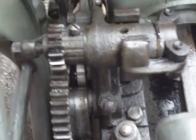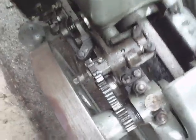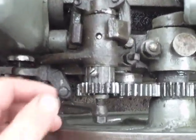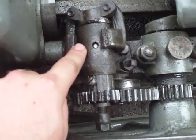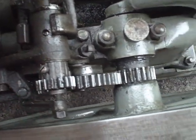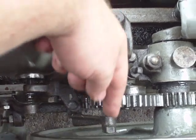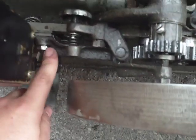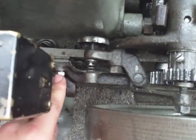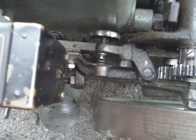There's a hump on there. Now, as we said about governors, if we don't have a governor, it'll continue to make this four-stroke cycle until the engine just flies apart. So as this engine's running, the speed of these weights turning in a circular motion — the centrifugal force pulls these weights out, which shoves a pin in the end of this hollow tube through the center of this shaft, and pushes out on this rod. And as this rod is pushed out, there's a little catch here, which you can see.